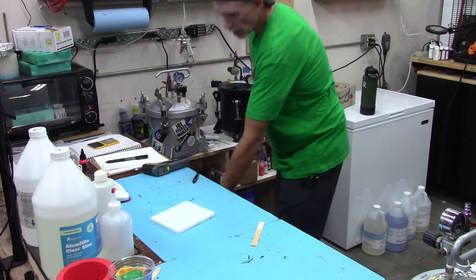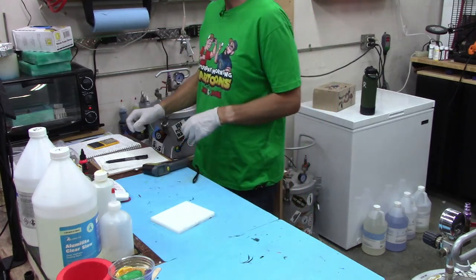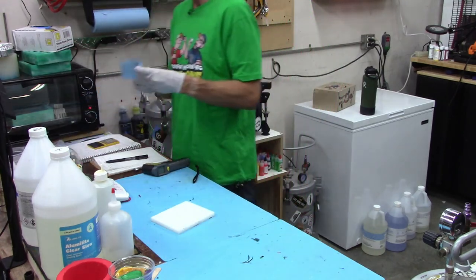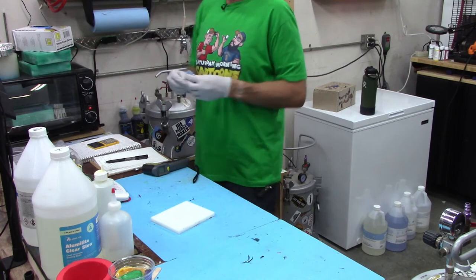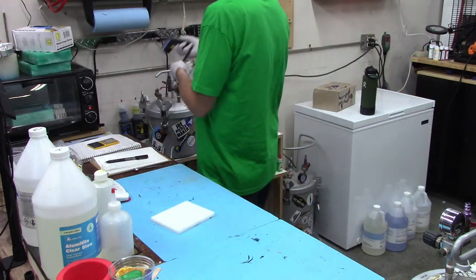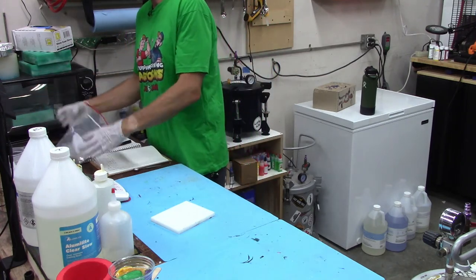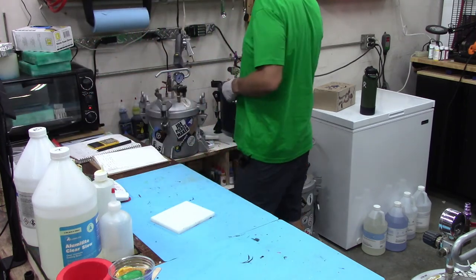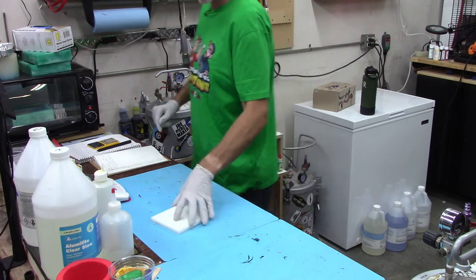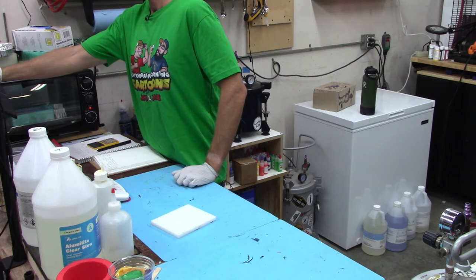One thing, if you have a SawStop, make sure that you turn off the brake when you cut these things. I'm going to have to really remember. Otherwise, it'll blow the brake off when you run into the honeycomb. So that's not a bad one to use the bandsaw on. I'm going to have to watch myself though. That's one of the reasons I don't really do a lot of honeycomb anymore, because I have blown so many brakes running into aluminum honeycomb. Okay, so let's see here. Yeah, you'll get what you get.